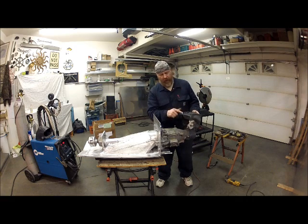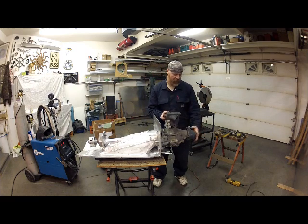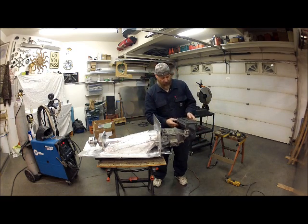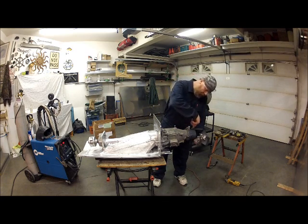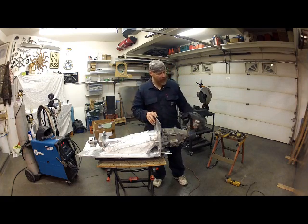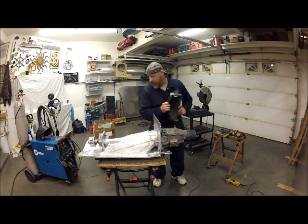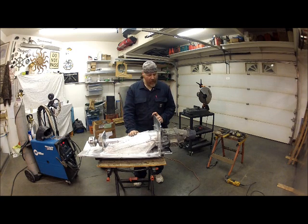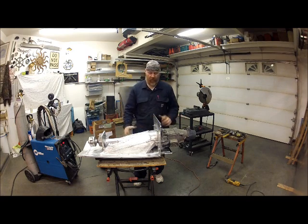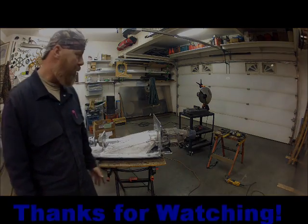There's a new end piece with brackets that hold a big reverse cup — I'm going to make my own, but to show how it works: when going forward, the jet stream blows out the back. When you want to stop or reverse, you slam this cup down and the jet stream hits it and redirects toward the front of the boat, slowing you down. I still have some welding and grinding to do, but in the next day or so I'm going to start building the boat itself, since this was the hardest and most technical part to build.